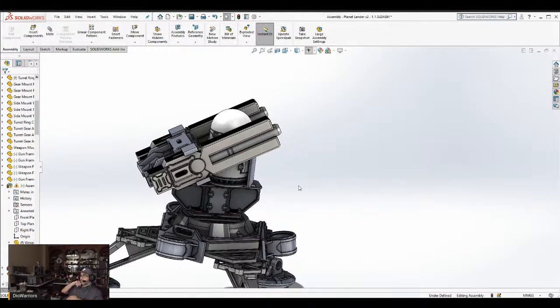And of course, when it comes to assembly, I think it's better for something like this to assemble it like a model. When it comes 3D printed, like a typical DioWarrior prop, you put it together like a model. If we do this as injection molded, I'll probably just include the sprues, so you treat it like a fine scale model and you cut the pieces and glue them together. So the weapon may come as more pieces through injection molding than for 3D printing. That means more molds, which means more cost. So it's a trade-off. You get a nicer looking piece, smoother and things like that, but it also means that for a Kickstarter, you have to hit a higher goal.